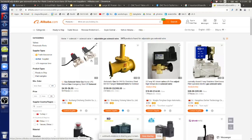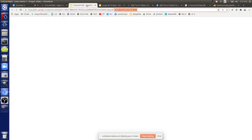Okay, so here's how you would do it. It's adjustable, but not electronically. I don't think that's adjustable electronically. But then you can have two valves, so turn on one for the regular flow. Then when you're starting to cut, just turn on the other valve, which has the very low flow. So that's quite within the territory of low cost DIY with basic logic, just turning things on and off. So very cool. That'll be the next step. We're not doing that. That's more advanced.